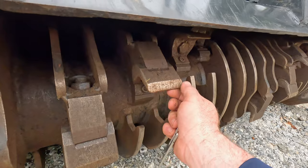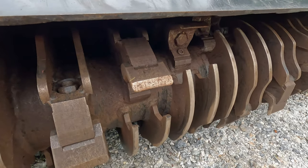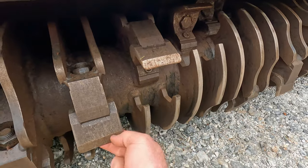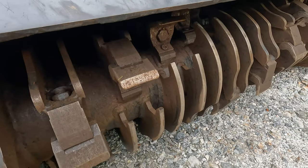Oh man, but I know it's not that hard to sharpen. Just get them sharp. You don't want to take too much material off the front and then you get a dive nose, but you want to take it evenly all the way back. That is basically the gist of it. These were still cutting good, but they're not razor sharp. Depending on what I'm cutting, I would probably keep running these. But I'm going to touch it up. Everybody has their way of sharpening. How much do you sharpen? How often do you sharpen?